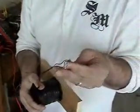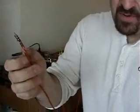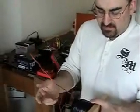This is one of our coils. I've shown these a little bit in my previous videos. If you look at the strands here, we've got five strands of magnet wire — magnet wire, they call it — used for coil winding. Each strand has got an enamel coating that prevents the wires from shorting together when you twist them up and wrap them around the coil. Each end that you burn off the coating has got a copper connection, and you get it out the other end. We take five strands of wire and twist them up in what's called a Litz style. When you take any number of strands and twist them up to use in the winding of a coil, they call it Litz winding.